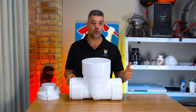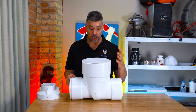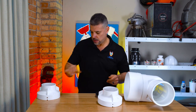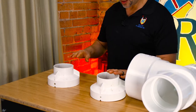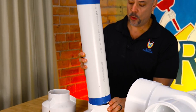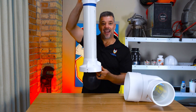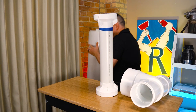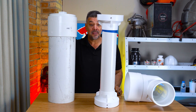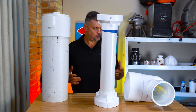The great thing about these clean check backwater valves is it's a lot cleaner servicing them as opposed to a flood control system where you have to climb through a manhole. The reason this clean check valve is so clean is because of these custom pieces from the manufacturer — you can literally just slide it out. That's why it's so clean and so cool.